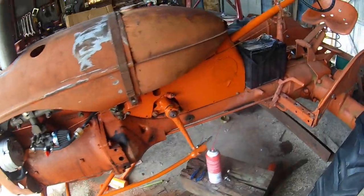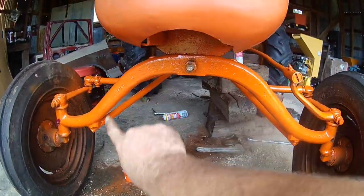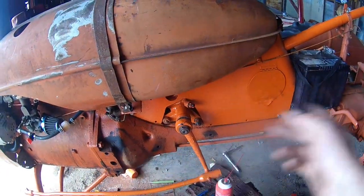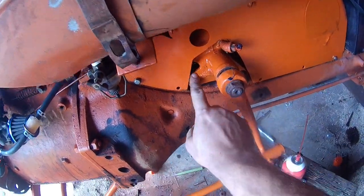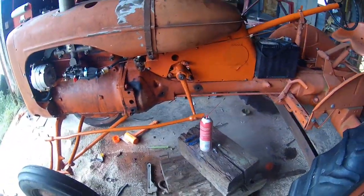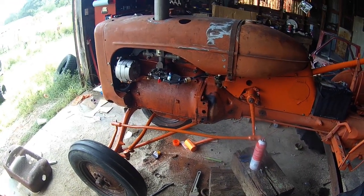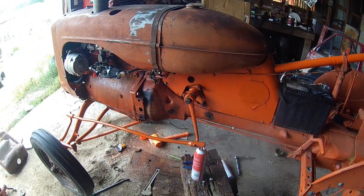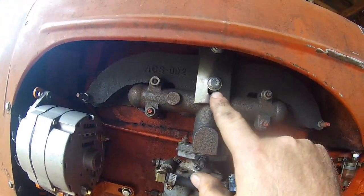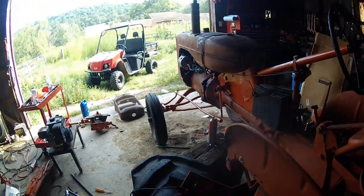I am ready for a break from this thing — this turned into a nightmare. I had one gearbox issue because this U-shaped front end is its own gearbox and the one I had was busted. I had to weld the back plate and get it on. Then I had a bolt broke on cast — cleaned it up, welded it, still holding. But we got the manifold on, muffler on, all's well. She's looking good, got it going, got the tricycle off. I'm happy.